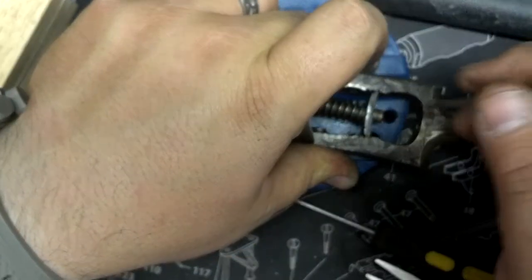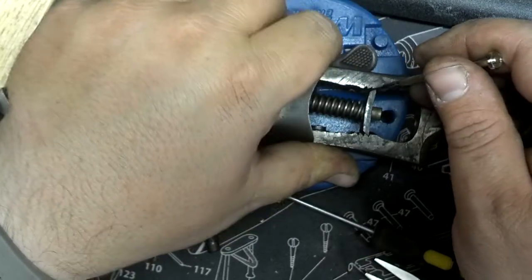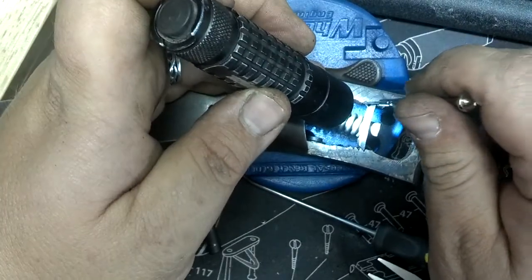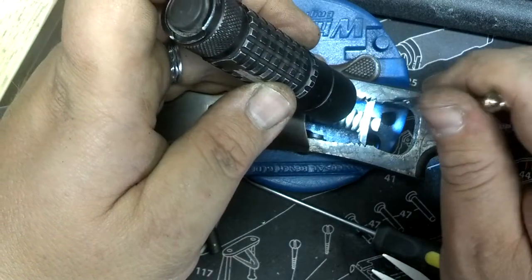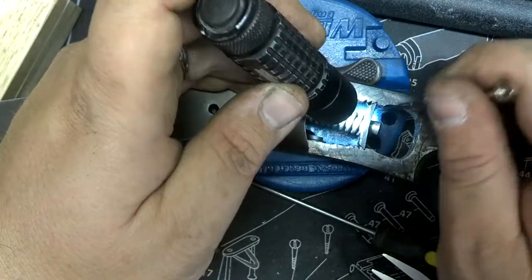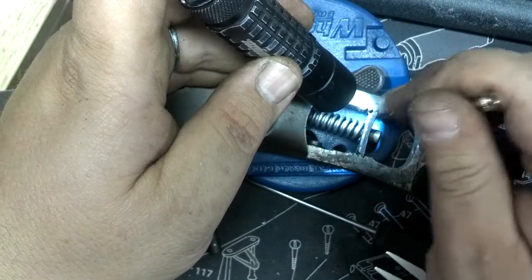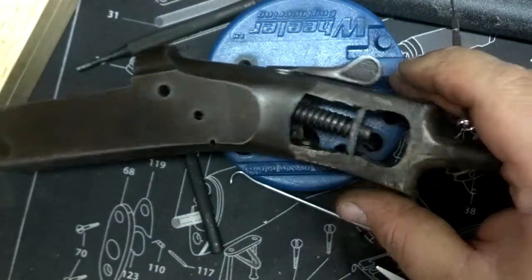See, the thing about this is you can slide it out and move it forward. I don't know if you guys can see these. Once you take the pressure off there, you can put it back in and move it forward if you need more pressure to keep the bolt hold closed, or the breech closed, sorry. And anyways, these teeth right here are for moving it forward or backwards depending on how much pressure or tension you need on the breech.